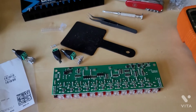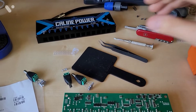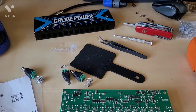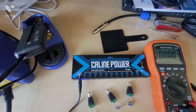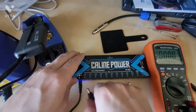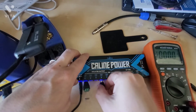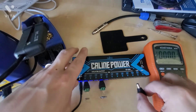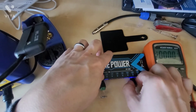This is definitely not a high power application. If you want something more than 500 milliamps, you're going to need a different power supply. But this should power more than 90% of all the pedals on the market today. We're going to plug in 100 ohms to the 100 milliamp line, 25–26 ohms to the 300 milliamp line, and 20 ohms on the 500 milliamp line.